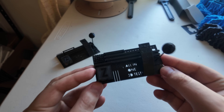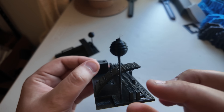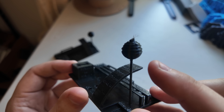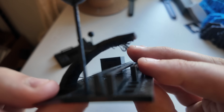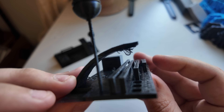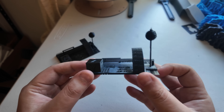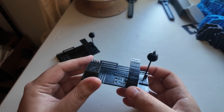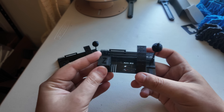Now we have the Centauri Carbon. Right off the bat, the surface finish is way nicer on this one — I noticed that immediately. The accuracy on this, while not great, is definitely noticeably better than the A1, or at least more consistent. One thing I'm not sure about is the overhang — I don't know if that's a cooling issue or what, but this is really impressive at a very steep angle. Everything else looks great. The bridging down below looks very consistent. I would have to say this one goes to the Centauri Carbon as well, because of the two noticeable improvements on this one versus that one.